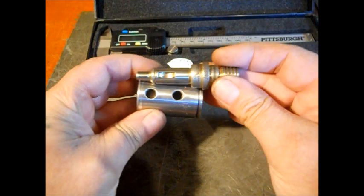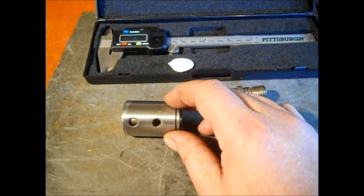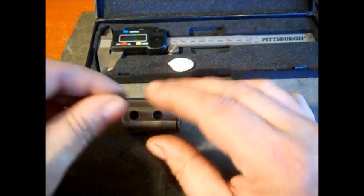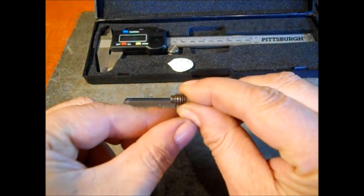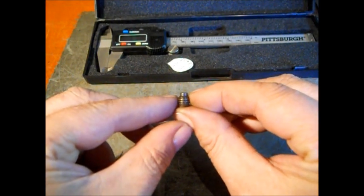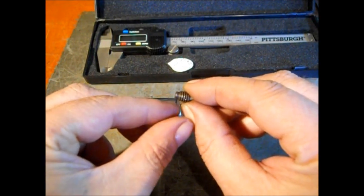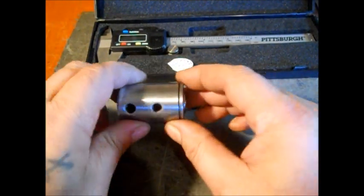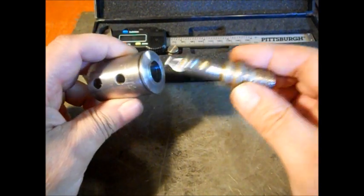We are plenty far away from where the screw goes. These set screws have a little tip on them that just fits into a dimple on the shaft, so you don't need a keyway. That's just how the pulley was on the original thing. I ended up with a pulley worth about $5 to $10 on top of it all.